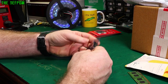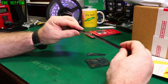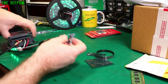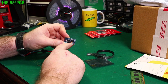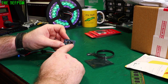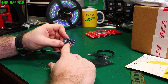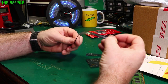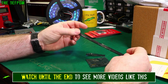I think I know what these are actually — there's no markings to say what they are, but I think these are LP2985 5-volt regulators. I actually need these for what I've got running over here. I've got a bunch of these Pro Mini boards — I don't know how many, maybe 20 or more. The voltage regulators on these things don't actually work. You put a raw voltage in — could be 8 volts or whatever, 12 volts in this case — and the voltage regulator wouldn't work, the board just wouldn't power up. If you shove it 5 volts in directly off the 5-volt pin or the VCC pin it would work fine. Probing around found the voltage regulator just doesn't work — it should work, it doesn't. So I've purchased a bunch of these regulators to replace the ones on these circuit boards, because obviously the ones on the boards don't work. Maybe they got fake ones when they bought the boards, maybe that's why those boards were so cheap when I bought them.